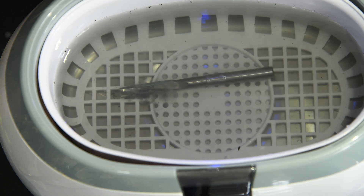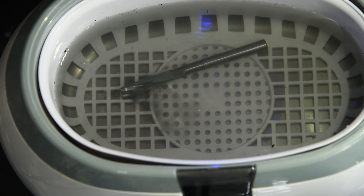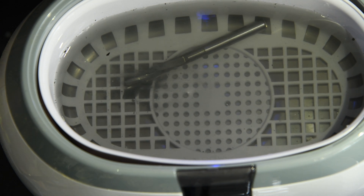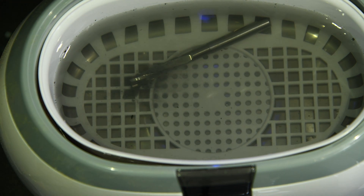While we were actually milling, after a cycle finished, we'd remove the bit and toss it in an ultrasonic cleaner, which did a great job of removing any buildup so that our wall finishes didn't get worse over time. Honestly, we're not sure whether this buildup is an actual problem because we never let it get too bad, so you could experiment with it if you didn't want to clean the tool so often. But the ultrasonic run was about 3 minutes, which is about the time it took us to vacuum up after a cycle and replace the milled foam with unmilled stock, so we didn't waste too much time here.